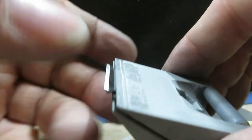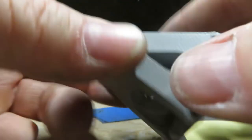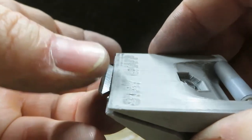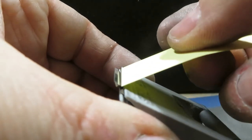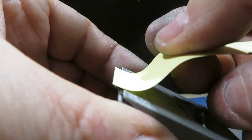It's hard to feel at 800-grit. You can try to feel it with a fingertip — I'm able to. No burr on this side; I can clearly feel it on this side. But again, if you don't have the ability to feel it, the piece of paper is an excellent test.